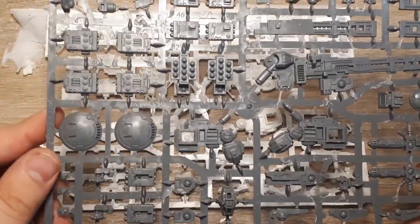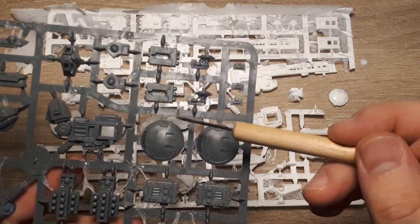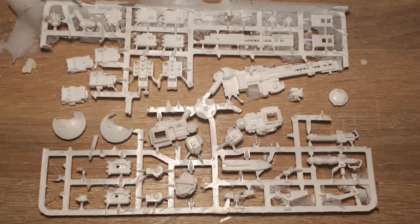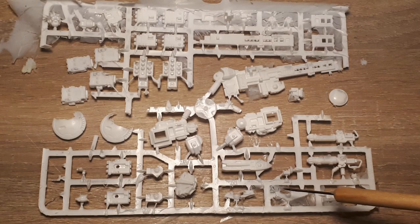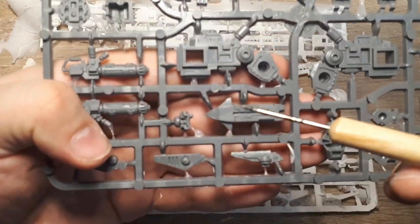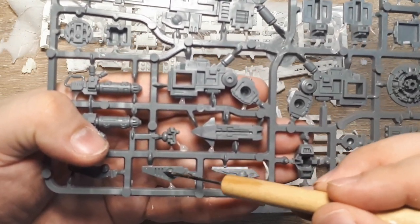Had I mounted this correctly, this vent would have been the one pointing up, and that bubble could have escaped quite easily. You can see how another bubble formed right here and right here. And of course, on the sprue, here's that spot right here, here's that spot right there. So of course a bubble would have formed right there.